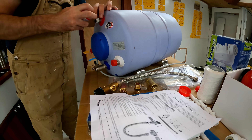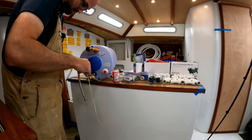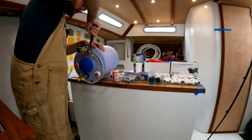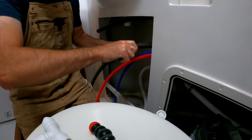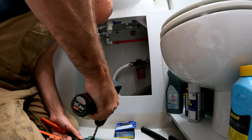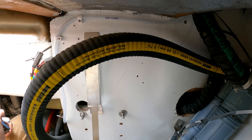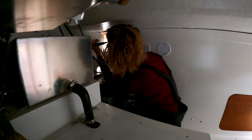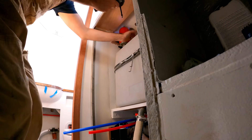The first thing I did was to install the thermostatic mixing valve on the water heater. This mixes a little bit of cold water in with the hot water from the water heater to make sure it's a constant and safe temperature. Instead of using regular Teflon tape I used Loctite 55 — I've never tried it before but it was pretty nice to work with. The water heater is going to be installed in the cockpit locker but it started pouring down, so I got started on the plumbing underneath the sink in the head instead. The quick connect fittings are easy to work with, and with the help of a few 90 degree fittings it turned out pretty spiffy looking. The rain stopped so it was back to the water heater in the delightfully cramped cockpit locker. With the supports in place, Eva tightened the nuts inside of the technical compartment, then it was on to the pump and the accumulator tank, both mounted inside of the poop tank compartment.